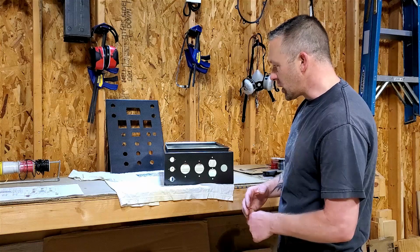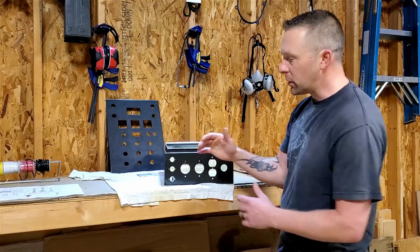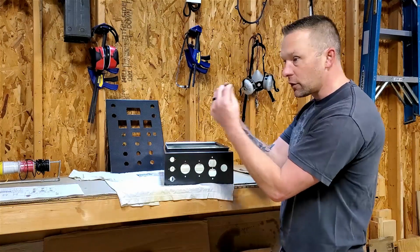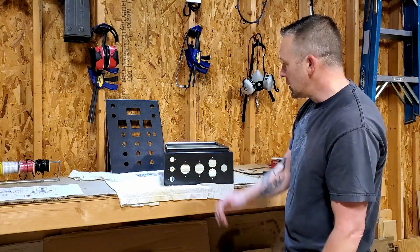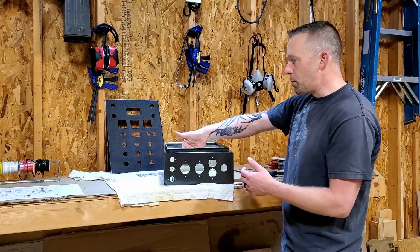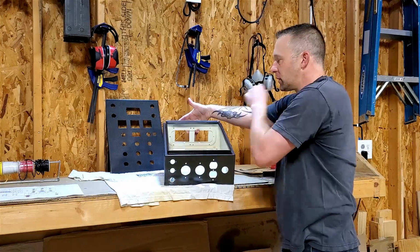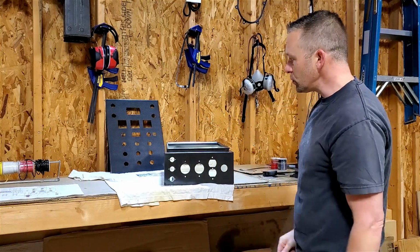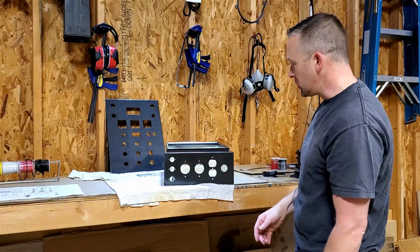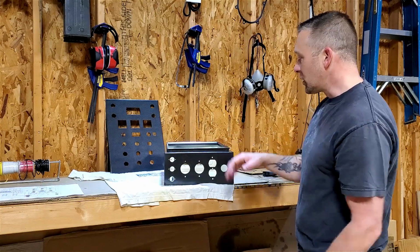Had a couple pieces where I had some overspray, and I actually ended up taping off and painting the inside of this lip because I forgot last night when the door closes, there's a small gap, so I would have seen like that vanilla cream color. So I went ahead and back taped the inside of this lip and scuffed this all and touched up the inside and then hit this all so it's got a good break between the two colors. And so this is still kind of curing up.